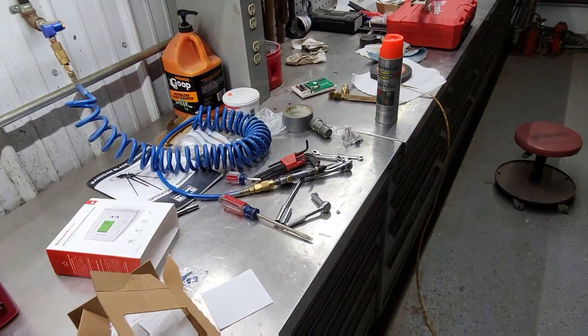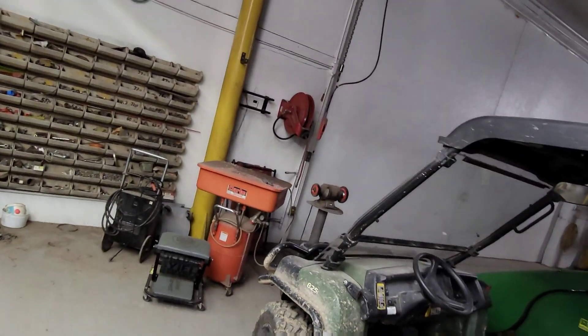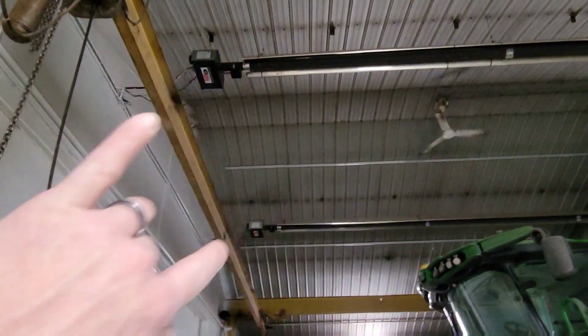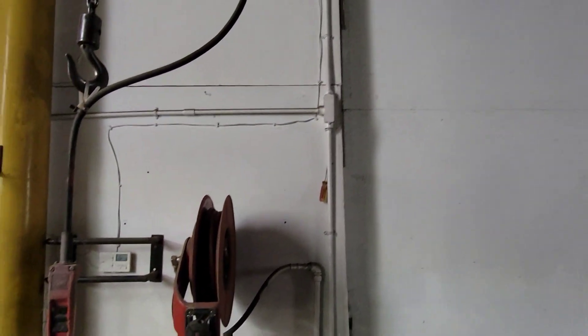It is about lunchtime so I'm going to go eat. But when we get back, I bought a new thermostat — we're going to fix that. And I've been thinking about whether or not we need two thermostats in here, because we have two heaters. They're separate systems and we've got them on separate thermostats at the moment. But if I just ran the thermostat wire from that one over here and tied it into one thermostat, that should control both of them. Any reason I can't do that?